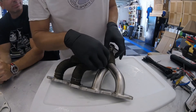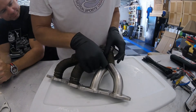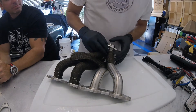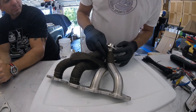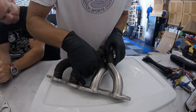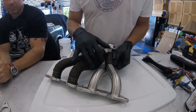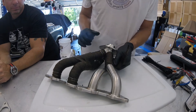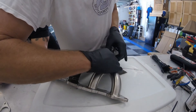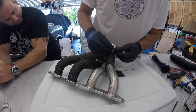We're working with fiberglass, so anytime you're working with fiberglass it's probably a good idea to have gloves on. I put some rubber gloves on so my hands look a little weird. First thing I did is wrapped it kind of loose. You want to start with almost a complete wrap, just maybe a little bit of a reveal — maybe a quarter inch reveal at the end. You can slowly start to wrap it around and tighten it up until you get to where the two pipes are joined. At the point that you like it, lock it in with a couple of zip ties. Zip ties are your best friends.